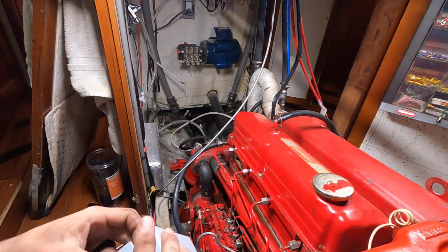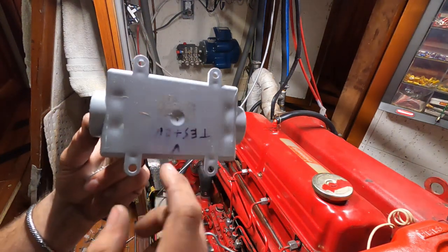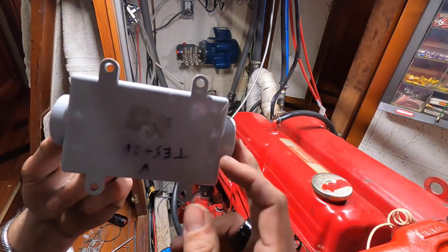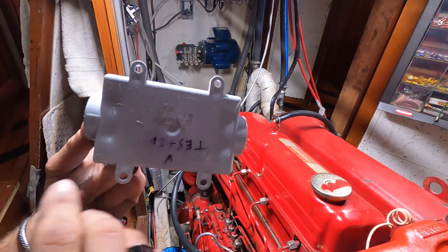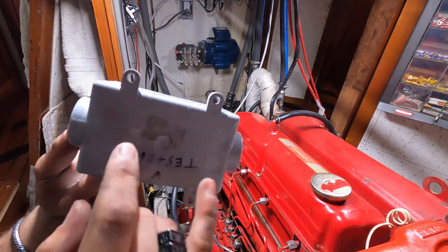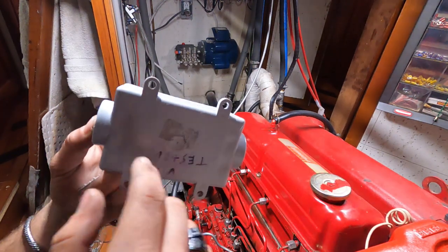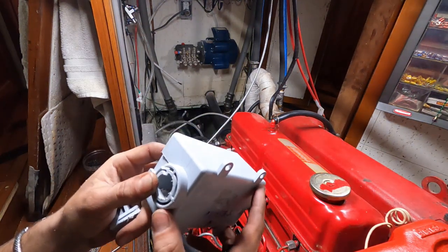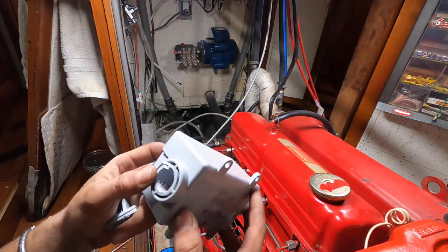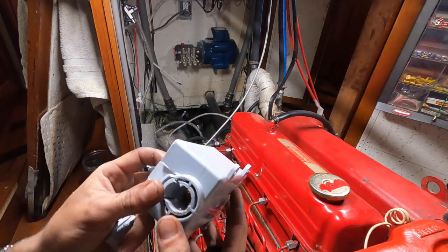One thing I noticed is you have this waterproof box for the back of the switches, but you have to run your 110 in and out, and then your 12 volt from your boost pump in and out, with screw-on style connections. That involves putting the wires in first, pulling this down, wiring everything up, and then putting it back. In my experience that's a pain. I don't want to do that. So hats off to all you guys that fought that.